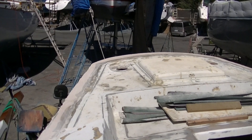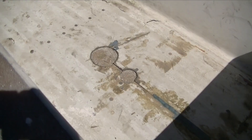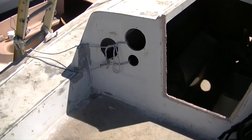It's an amazing amount of holes that have been filled. If you look around the boat, there are just hundreds and hundreds of holes that have been filled everywhere you look — that was a big job. You have to get in underneath and tape them and then fill them. We still have some work to do in the cockpit. There were some repairs made there — the old gas fuel fill ports are going to be taken out and ground out, and then the entire cockpit will be re-glassed. The bridge deck near the companionway also delaminated, so we've laminated in new material from the back and we're going to add another layer on top.